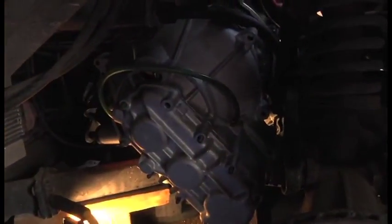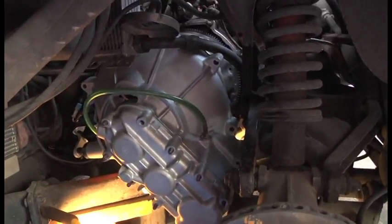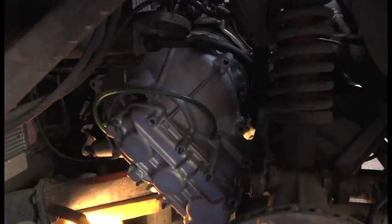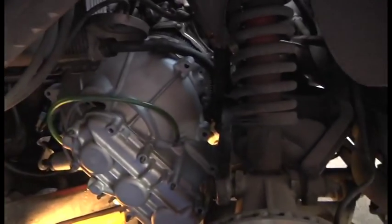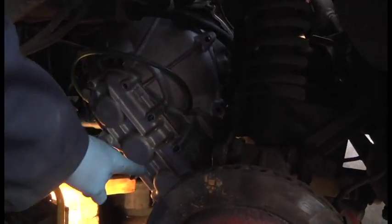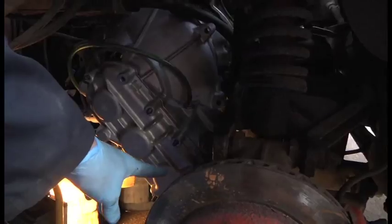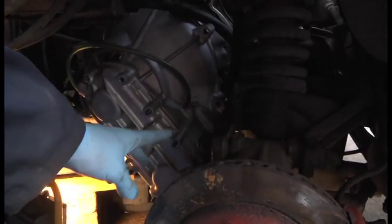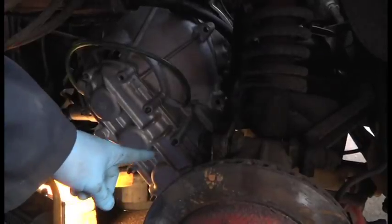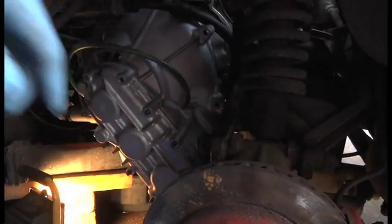Damn, I wish you guys had seen me do that. That went on really rather easily, with the camera out of the way, I can just get in there and get it straight on. The key to doing this is to make sure that the remaining stud, so you've got the shaft and then a shorter stud and a longer stud, it's the longer stud, just make sure that doesn't foul. The trick is to get it on the shaft first and then you can rotate it, but make sure you're clear of the longer stud.